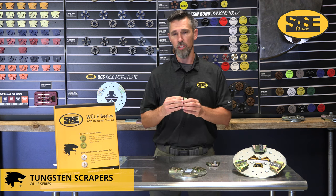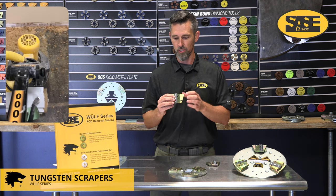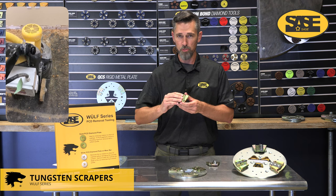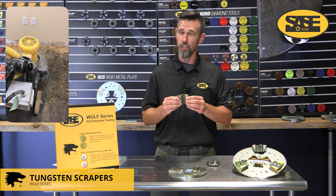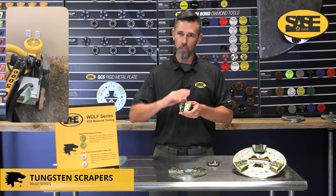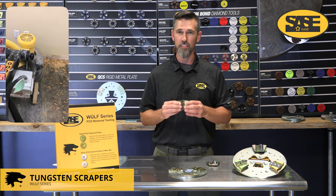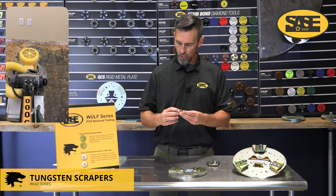These are designed to go over smoother surfaces — if you've got a really beat-up floor this is not ideal, as they're pretty brittle and will chip and break. For smooth or power trowel surfaces or ground prep surfaces, these are ideal for really thick gummy sticky glues. If you've got a really dried-out thin glue you're better off using a 40 grit metal bond or even a wolf claw to remove that.